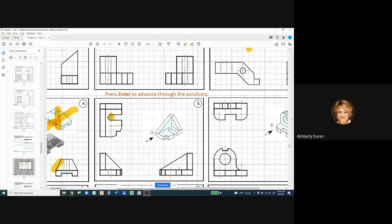I'm always going to dimension the center of a half semicircle, a full round, or a circle from the center. So I have to have a center mark on full rounds and larger — all the way up to a circle. We don't need a center mark on that bottom quarter round. So I'm going to clarify this because we're not going to put it in a drawing. We will not have this one, we will not have that one. These two were in alignment and I need this. And I need this one because they're 180-degree rounds, which we call a full round.